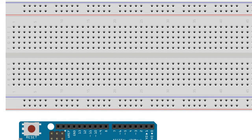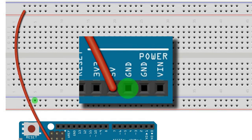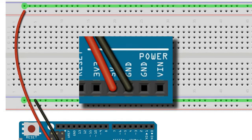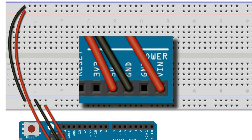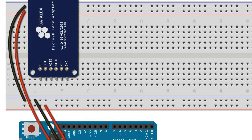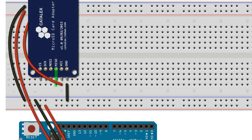Let's start by wiring up our breadboard's power supply. First off we unplug our Arduino from any external power. We connect the 5 volt pin to the upper positive rail of the breadboard, the Arduino ground pin to the lower ground rail, and bridge the lower and upper rails with a jumper wire. We connect the VIN pin from the Arduino to the lower positive rail. We add the micro SD card adapter to 6 rows of the breadboard, connect the adapter's ground leg to the lower ground rail, VCC to the upper 5 volt rail, MISO to Arduino pin 12, MOSI to Arduino pin 11, SCK to Arduino pin 13, and CS to Arduino pin 10.